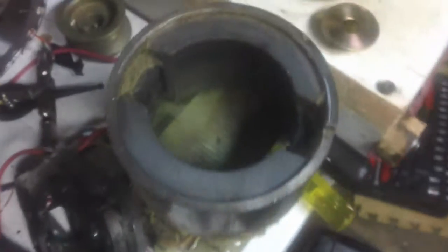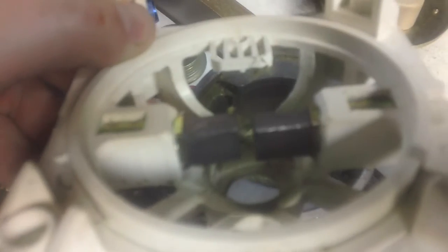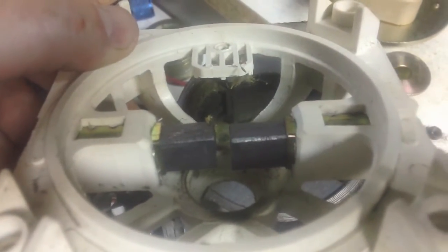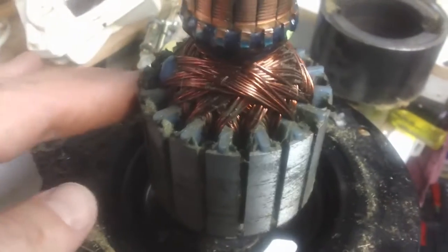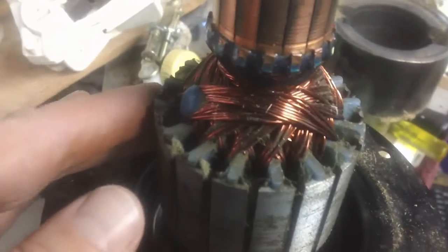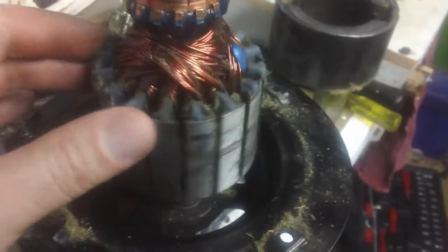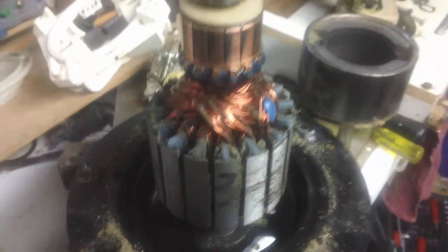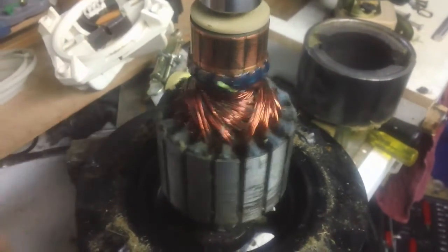There's a magnet here and a magnet here. Look at the size of those brushes — they are massive. When I ran this, I only got about 0.45 volts when it was run at 1150 RPM, so it was not what I expected. I thought maybe I could charge batteries with it, but I'm not gonna get anything remotely close to that RPM.